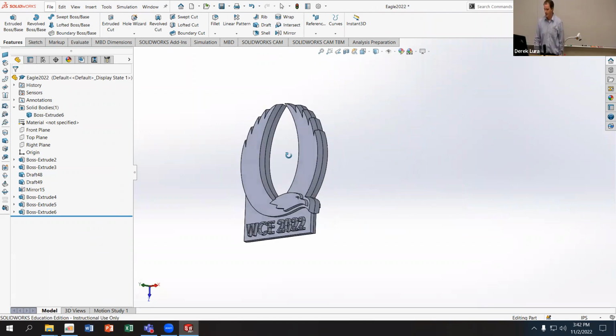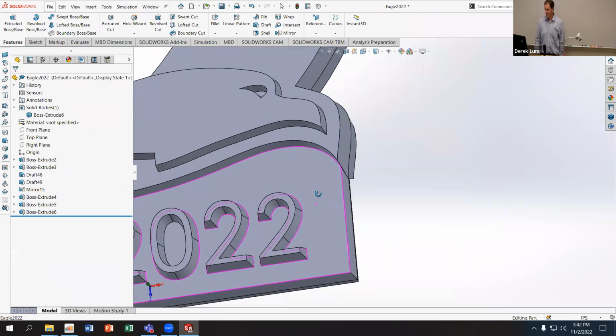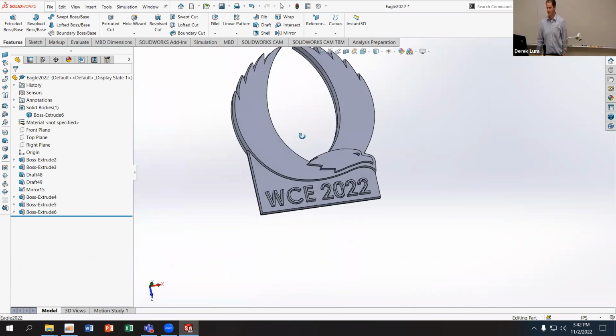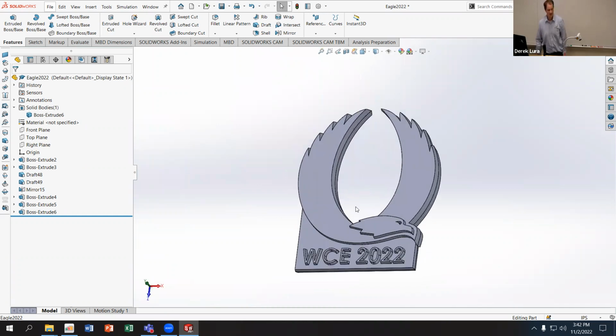All right. What I really want to cover today is some of the different aspects of molding and what we can do to make parts easier or harder to mold, to get those parts out of the mold, and to have fewer issues with voids and all those different kinds of things. The first thing that I have to consider when designing a mold for a system is how do I get the material into the mold cavity?